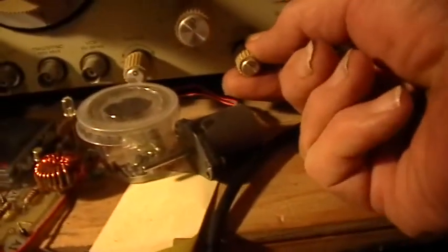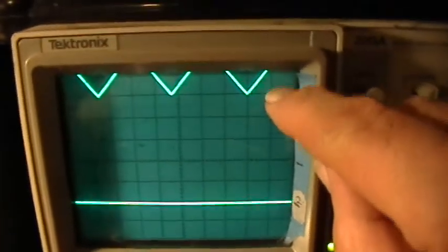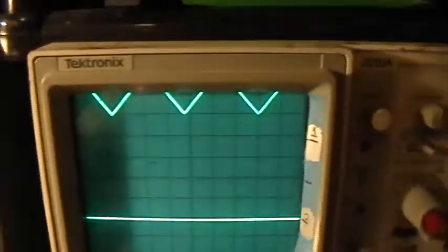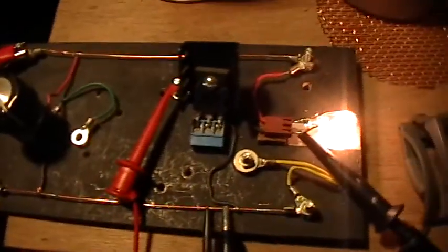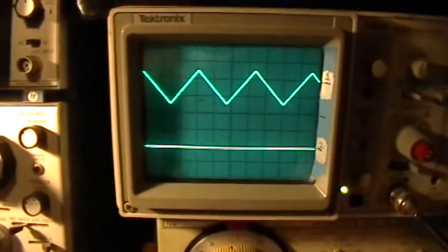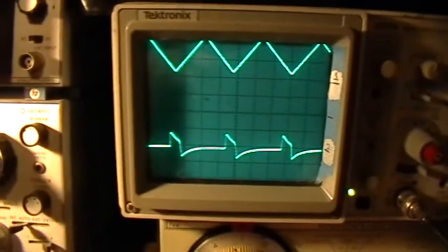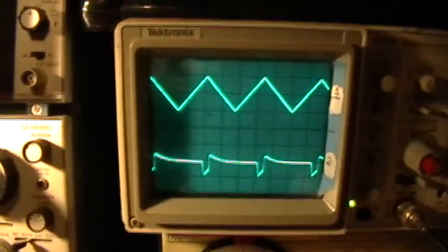This Interstate F43 high voltage function generator is capable of 40 volts peak to peak. So even turning the offset knob up that far — which is only about a 10 volt positive offset — the MOSFET stays on 100% of the time. It's not switching at all. And if it's carrying any kind of current, it's going to get warm. Is the message beginning to sink in here? Offset cranked up — MOSFET stays on 100% of the time. Thank you for watching.